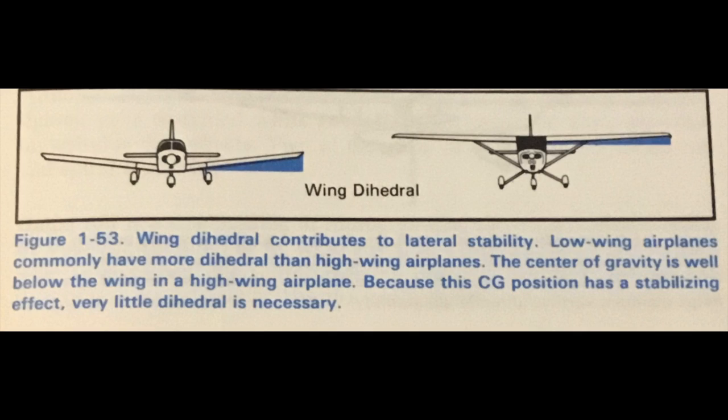We have to do this on this kit, and it's a good learning lesson. The second thing we want to do — once the angle of incidence is established and we've got the holes drilled — is hinge the wings up to set the dihedral. Dihedral on the Bearhawk is going to be one degree.